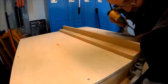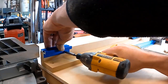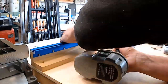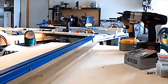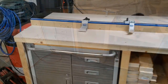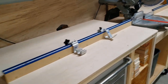Now we're ready to start working on the Kreg Accu-Track system. You'll need to pre-drill the back of the track. I did cut all these to length. Once we have the holes pre-drilled, I'll put a couple of screws to set it onto the fence. Once it's all lined up, I'll also use my drill bit to countersink a little bit into the aluminum and then finish putting screws in all the way down. We'll do that on the other side as well. This system comes in four four-foot pieces, but depending on where you set your saw you might have to cut it. Now we've got it in, the peel-and-stick measuring tape is on both sides, and both the movable stop and the permanent stop are on there. It really wasn't that hard to put together — it is a little pricey, but it's really wonderful.